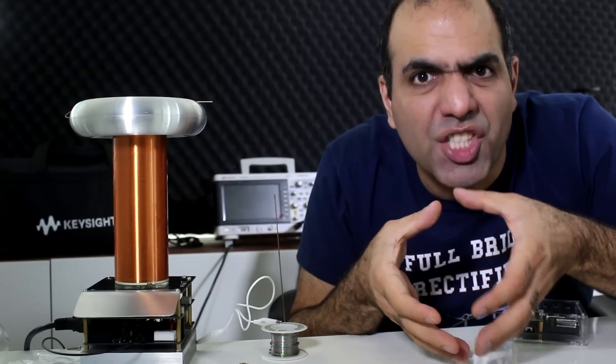Time to check the low power circuit. Let's power it up. It's definitely beneficial to check the direction of your components before powering it up — fortunately I think I have a replacement. This thing is an optical fiber that goes between the interrupter and the Tesla coil driver. The interrupter generates pulses with a certain frequency that turns the output power on and off, both to generate sound and to limit output power so the circuit won't overheat and blow up. It is connected to the driver circuit with optical fiber, which is not electrically conductive, so noise and radiation from the output won't mess with the interrupter circuit. I went ahead and got one of these fume extraction fans — it's only $28 from Circuit Specialists. It sucks the solder fumes away from your lungs and absorbs some of it too. I'll leave the link in the description.